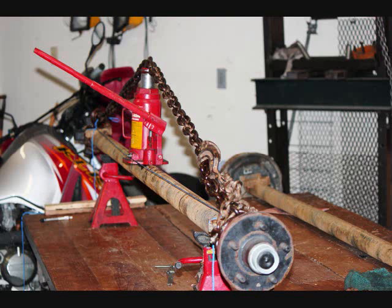We're going to bend these with some rudimentary tools that we should have in almost every garage: a logging chain and a bottle jack. It doesn't have to be 12-ton — I bet you can get away with five ton. But to concentrate that much power bending metal is just amazing. Here we have trailer axles made of two-inch piping, and we'll see what we can do with just some basic tools.